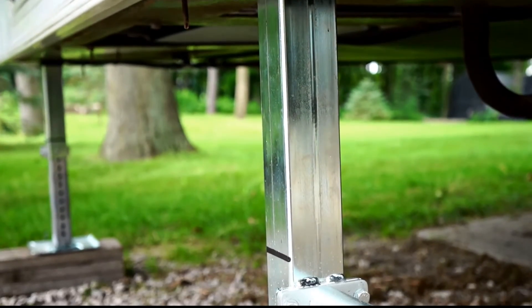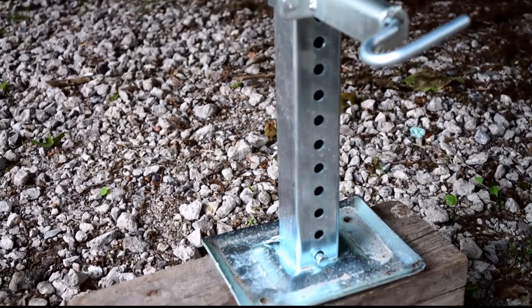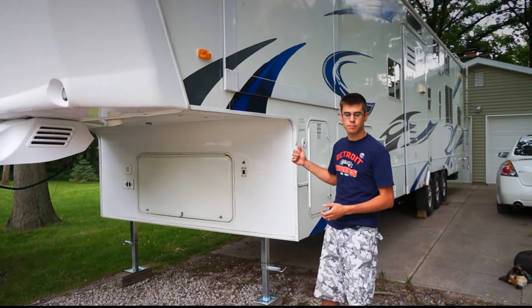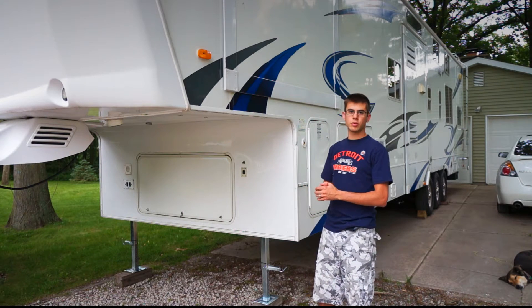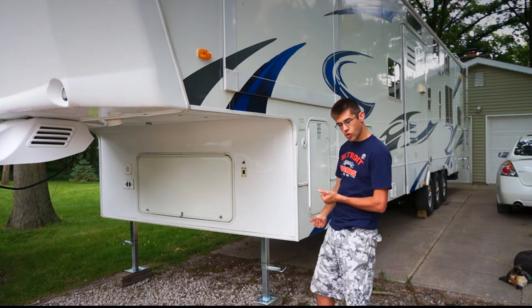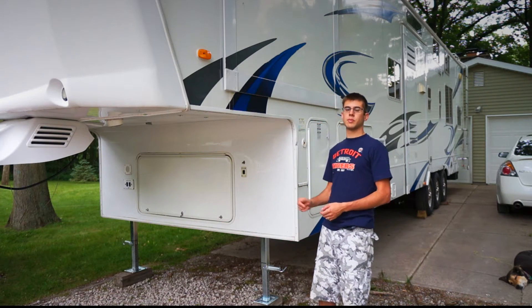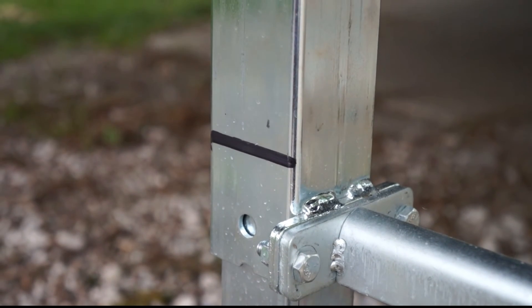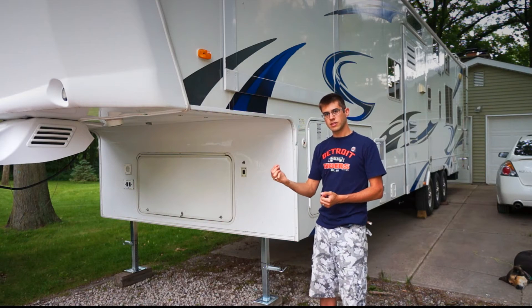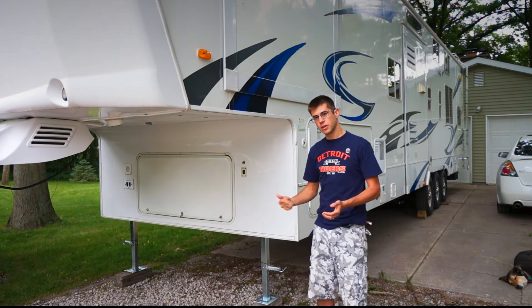We finished the install of our new landing gear on our fifth wheel — a 2010 Cyclone Toy Hauler, about 40 feet long with the generator up front. If you have a generator you can replace your landing gear without removing it, but it can be very difficult. A couple of last notes: remember to install the drop leg when you put the foot in — we forgot to do that and had to dig a hole in the ground. Also remember to mark the landing gear legs at the maximum and minimum points. Most new models have a breaker to prevent damage but it's best not to test the limits. Feel free to leave a comment if you have a question.